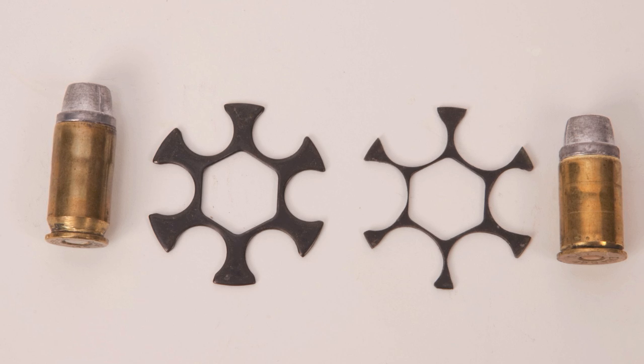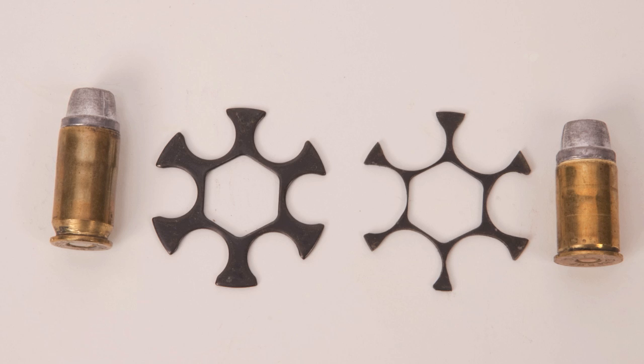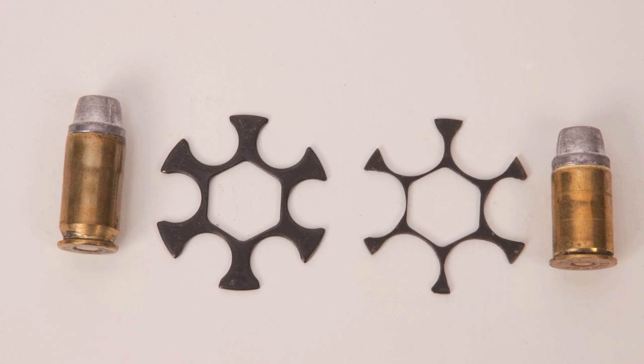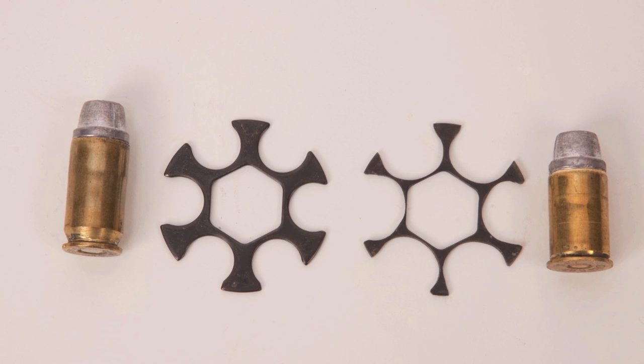If you have a shaved Webley, you can still shoot 455 Webley ammunition itself, and in my experience, this ammunition, if it's loaded right, is extremely accurate. And all you need to do if you have a shaved cylinder is take a 45 ACP full moon clip and a Dremel moto tool with a sanding head on it, and open up those clip openings so that it can accommodate the 455 Webley. And if you do that, you can shoot those 455s right in your shaved gun, and I do it all the time. It's a great shooting round.